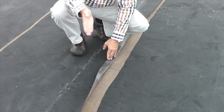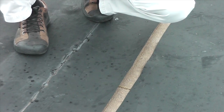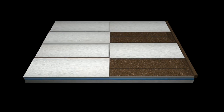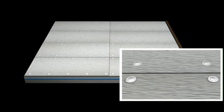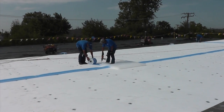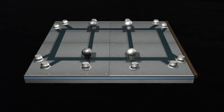If we pan down, we'll see a little bit about how we go about opening up the roof system prior to laying insulation. What we'll do is take the roof, serrate it about every four feet, and lay our insulation over the top of that. Then next, we'll put our air mesh materials down along with our special venting process that will help evacuate any type of moisture in the roof system.